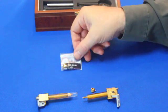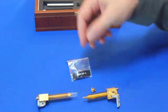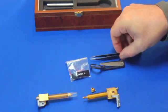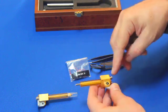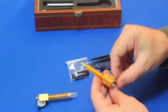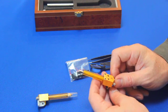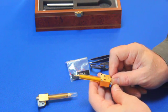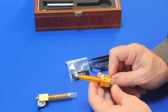To convert it into a 50 ohm probe, we have this kit — it's got a set of wires, shrink wrap, and a shorting cap. Using the additional tools that come with it, including a magnifying glass and tweezers, we wire-wrap one of the probes and put the shorting cap on this end. Now this side can be used as a 50 ohm probe with about four picoseconds of loss — ideal for high-speed TDR failure analysis, or with a spectrum analyzer, which requires a 50 ohm input. You can do a 40 gigahertz measurement sniffer application with spectrum analyzers, and the probe maintains phase measurements fairly well.